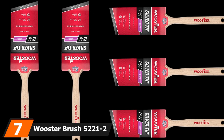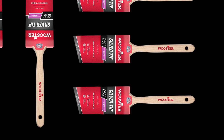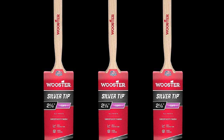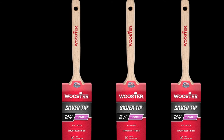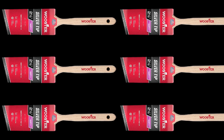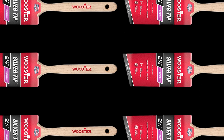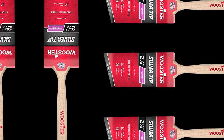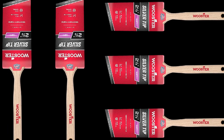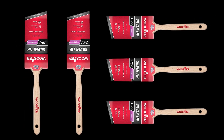Moving on to number seven, the Wooster Brush 5212-2 Angle Sash Paint Brush. Wooster is one of the most recognizable and trusted brands for painting supplies. This brush has a comfortable wooden handle with a remarkably smooth surface — it feels great in your hand and is strong enough to last through many uses. The bristles move fluidly and allow for good coverage and movement while you work. I've used this brush for several months' worth of projects without ever having to pick loose bristles out of my recently applied polyurethane. They're made out of polyester, which makes them a breeze to clean and able to stand up to washing and solvents. The painting edge is angled, so you can easily access corners and edges on your workpiece. It's two inches wide, making applying polyurethane to large surfaces quick and painless. This brush is made in the USA, so it's an excellent option for those looking to support American businesses.